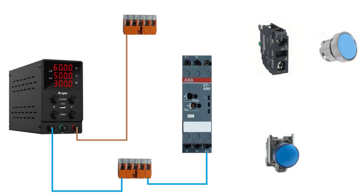From the 24 voltage plus WAGO connector, I will wire to the normally open contact block. Then from the contact block to the A1 terminal on the timer relay.